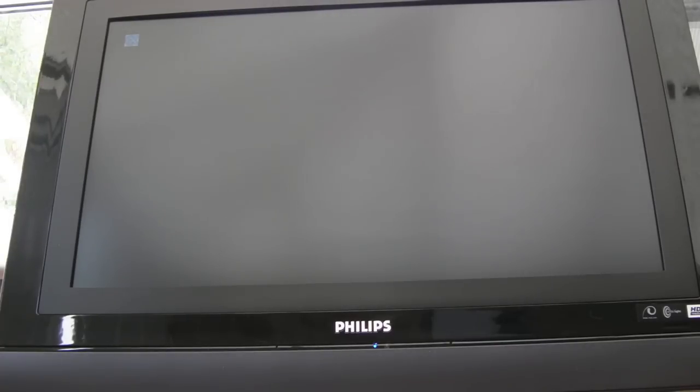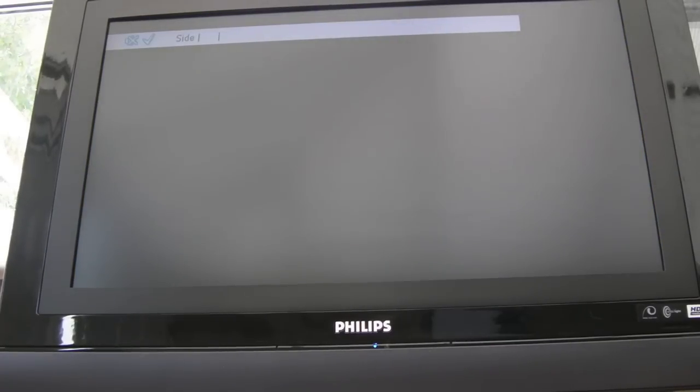Now I've ordered a 555 timer because I am not convinced the reset is happening correctly here. The timing could be slightly out. Again, I'm pressing the caps lock. We've just got a black screen, nothing. Let me just watch what happens. So leave it off for a period of time here, for maybe 6 or 7 or 8 seconds. Not very long at all.